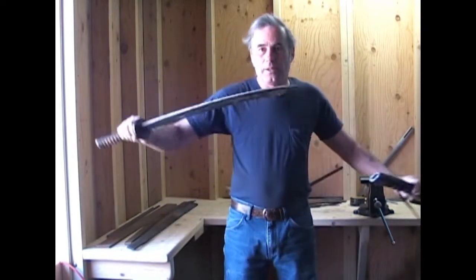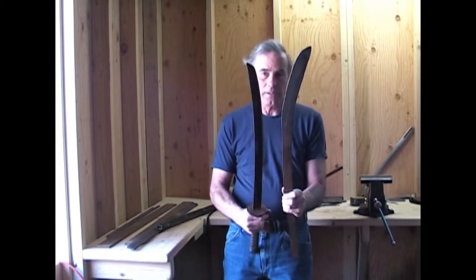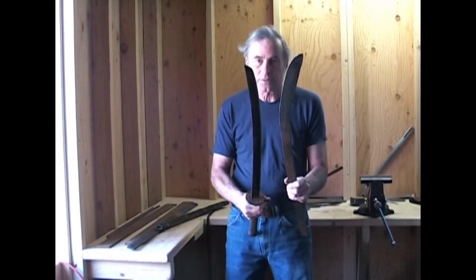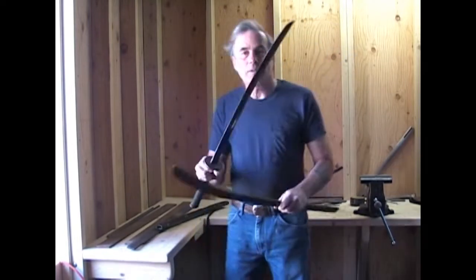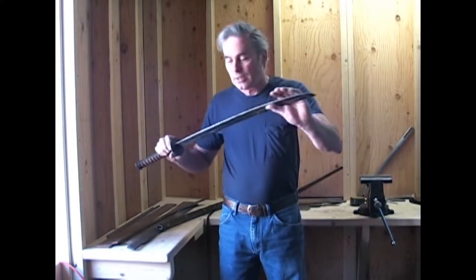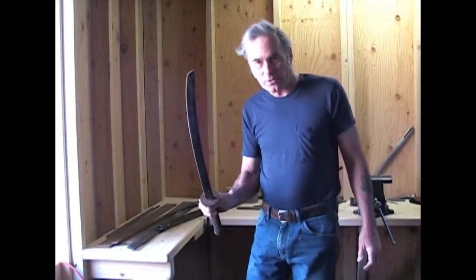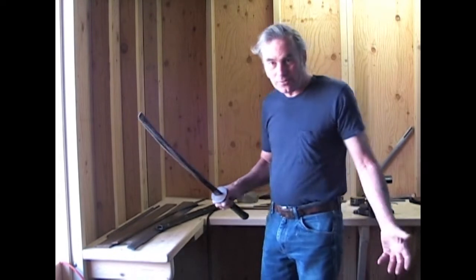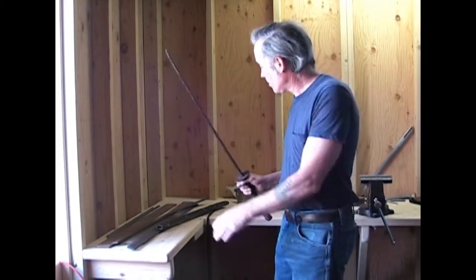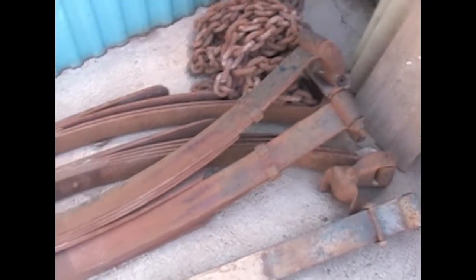This is my samurai sword — I made this several years ago out of spring steel. In fact it's the matching piece to this cutlass blade; I cut a piece of 2.5-inch wide spring steel down the middle with a hacksaw. I normalized it with the torch, and I've used it to chop firewood and shape timbers. It's very strong, springy, and holds an edge fairly well — probably not as good as if it were hardened and tempered, but it's a really tough blade. That's the process I'm going to use on these two other sword blades.